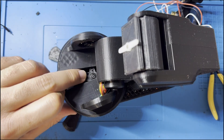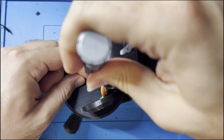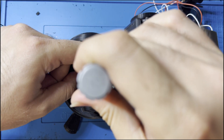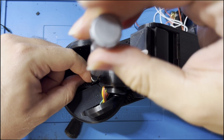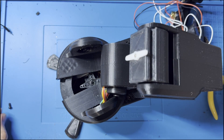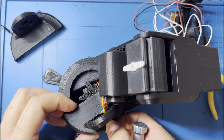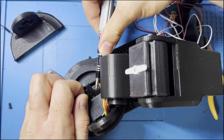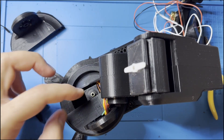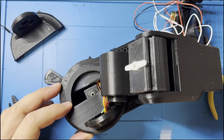You also need to open this screw and release this servo motor head so it can move easily. Then when it's in the zero position, you can place it exactly like this — so we know that this position is zero. The same applies for all other servo motors.